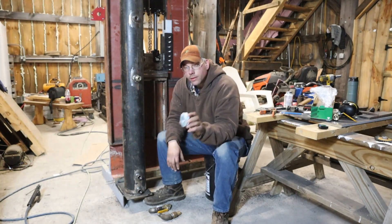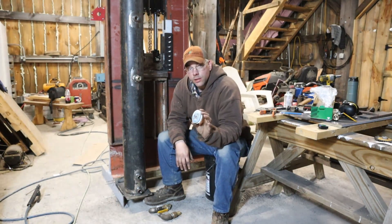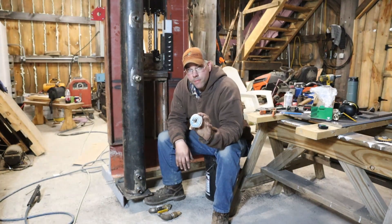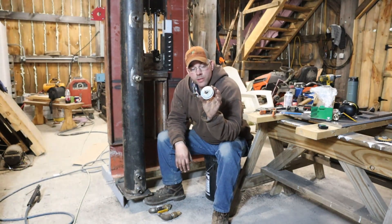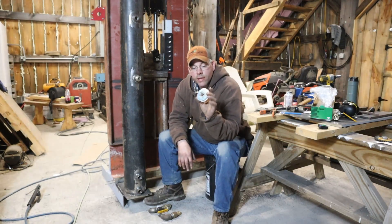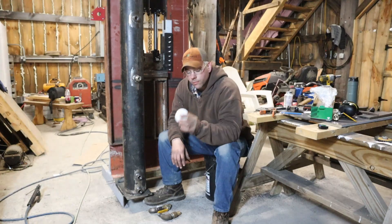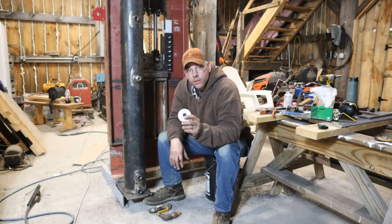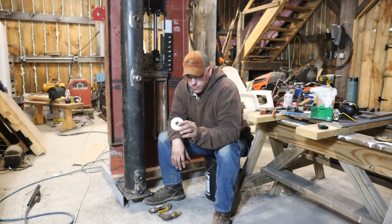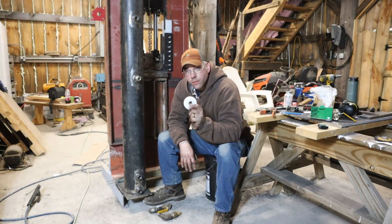There are specific types of Teflon tape for specific duties. This is Blue Monster - the blue Teflon tape - and if you go on their website you can look up all its intended uses. This is intended for hydraulic and water applications, pretty much the Heinz 57 blend of anything you're going to need with Teflon tape. According to factory ratings you can use it with pretty much anything. We use this at work on pipe fitting, boilers, oil lines. I'm going to show you a couple things to avoid getting this stuff through your piping system.